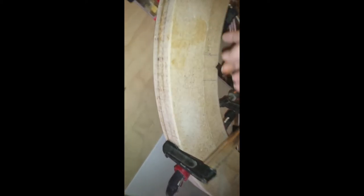And in the garage here's the rest of the ancient Assyrian wheel, so you can see that section there is the actual rim, and these are the wooden tires, and that's rebated in there. There's a dado that goes all the way around on the inside of the rim, and these wooden tires have got a tongue which sits into that dado created into the rim.